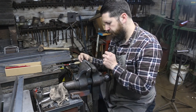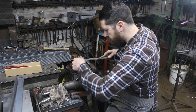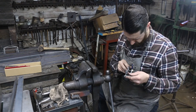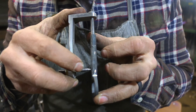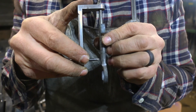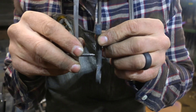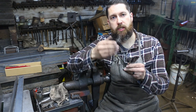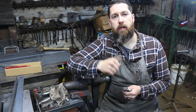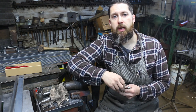I can still take some material off this side. Hopefully you can see down here there's a little bit of a gap — it's maybe a 32nd of an inch — and if I flip it to this side it widens up to about a 16th of an inch, so I'm a little bit better than when I started. I'll continue using this gauge and filing the key stem to check my accuracy of the bore hole and make sure it's relatively centered. If you enjoyed this video, make sure to give it a thumbs up, subscribe to my channel, and check the links in the description below for my Instagram and my website where you can purchase some things to help support me and this channel. Thanks again for watching, bye!